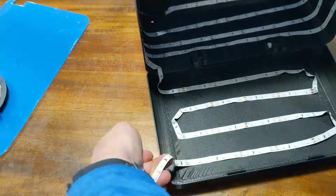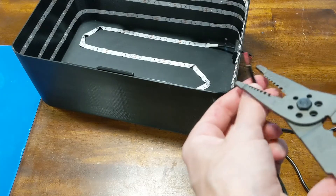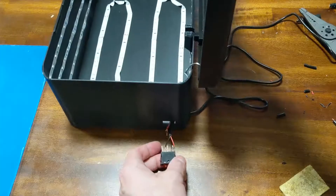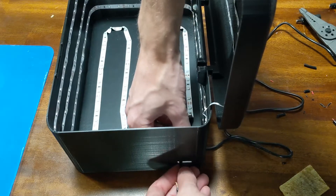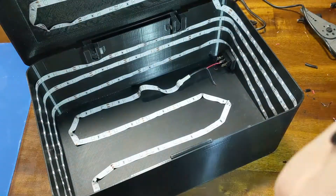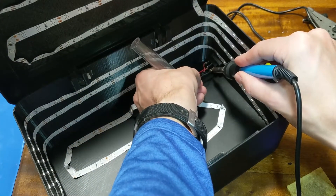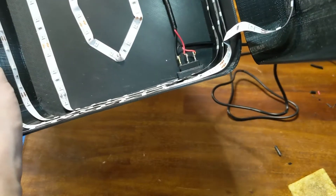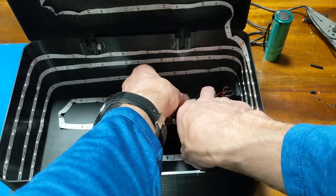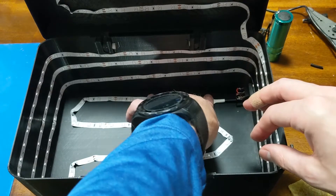Thank you also to viewers — you are awesome! I also had a little bit of extra on the lights, so I just cut the end off and then went to the power supply. I made sure that I had all my wires stripped and ready to put onto my power switch. I tried to do it on the outside of the box, but the cord was a little bit too short, so I had to pull it in and pop it into the box, and then I was able to do it more easily from inside. Something to think about when you put yours together. I solder all of my wires onto the pins — just make sure you check the diagram on whatever kind of switch you get. Power supply on the outside with the light in the middle, and both of the negative wires on the gold pin on the other side. Then I put the wires underneath where I soldered to make it nice and neat and able to put the plexiglass on top.